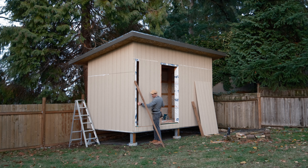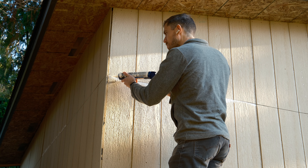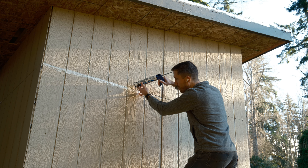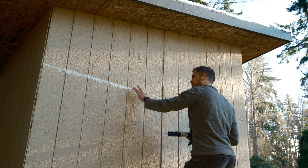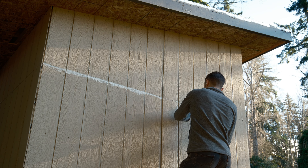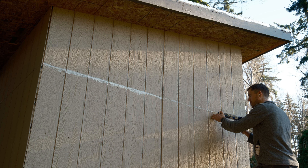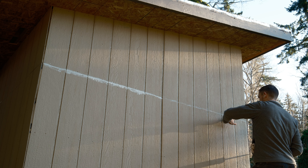After the soffits were done, it was time to close up shop for the day. I think you're technically supposed to add flashing at any horizontal panel gaps like this, but I decided to try my luck with just some caulking. One note about caulk: I started off using some cheaper white trim caulk, but I actually had it freeze and crack on me overnight. So I ended up switching over to Lexel — it is way more expensive, and it's amazing. It sticks to everything and has stayed super nice and pliable even through some 7-degree Fahrenheit weather. Highly recommend that stuff.